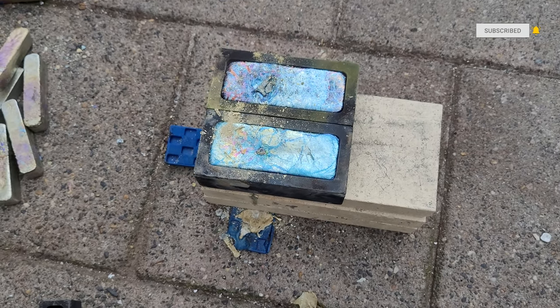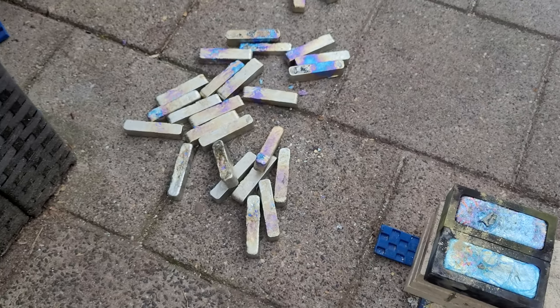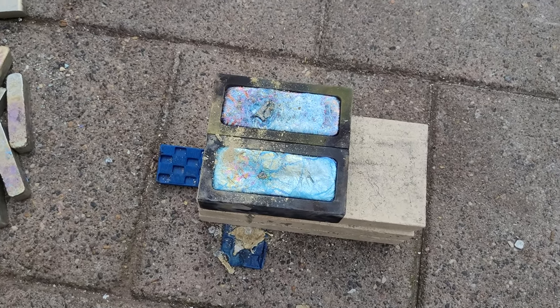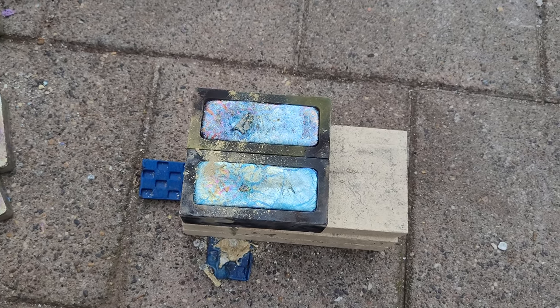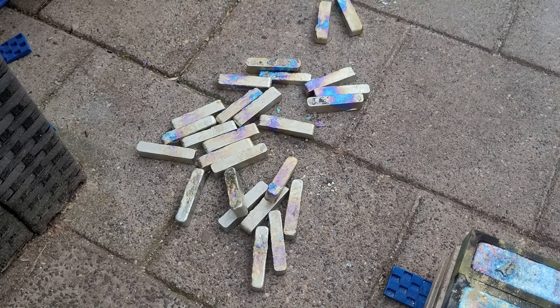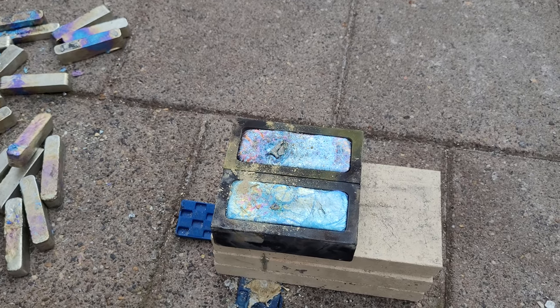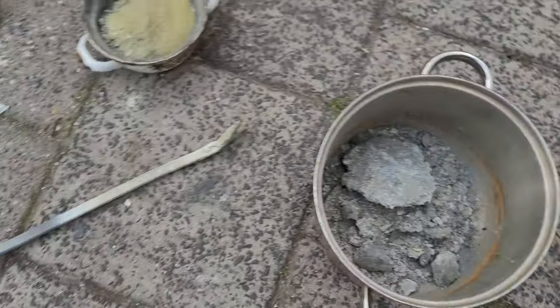Alright, so there was the last pour, made two bigger ingots. I think we have a lot of smaller ingots and I want to melt with the electric furnace, but I'm not sure if these ones will fit the crucible. If the bigger ones fit the crucible, I could better have made a lot of big ingots, saving me a lot of time, but I'll get these last two out. I will not quench them because my quenching pot is full of dross.